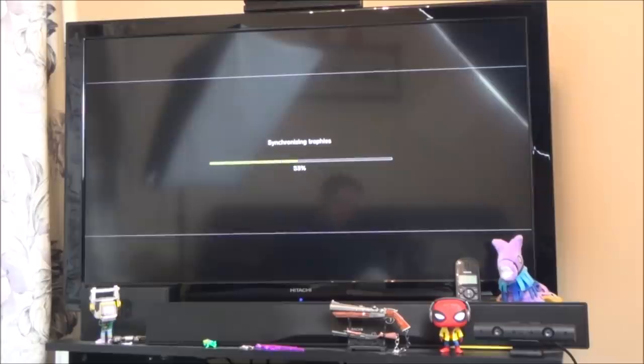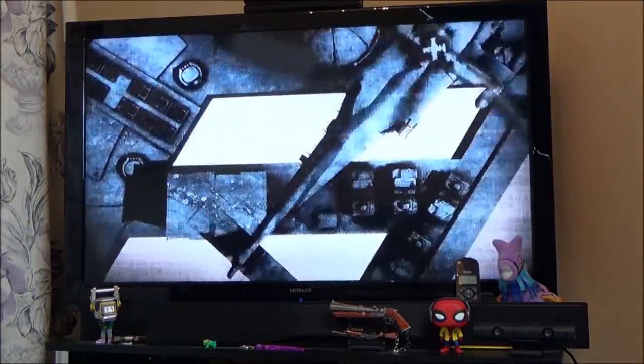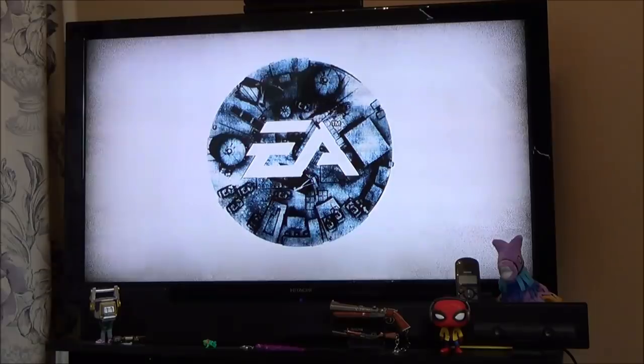Yeah, there it is. Wow. So what I need to do now is order up some of these tantalum capacitors. I think it's supposed to be 6 volt. It doesn't really matter about the volts, does it? But they need to be 470 microfarad each. The ones I've put in at the moment are 25 volts, but I think the ones they recommended were 6 volts.